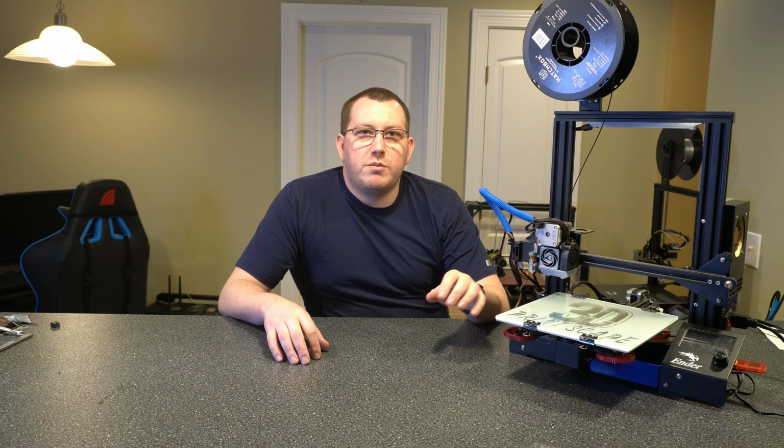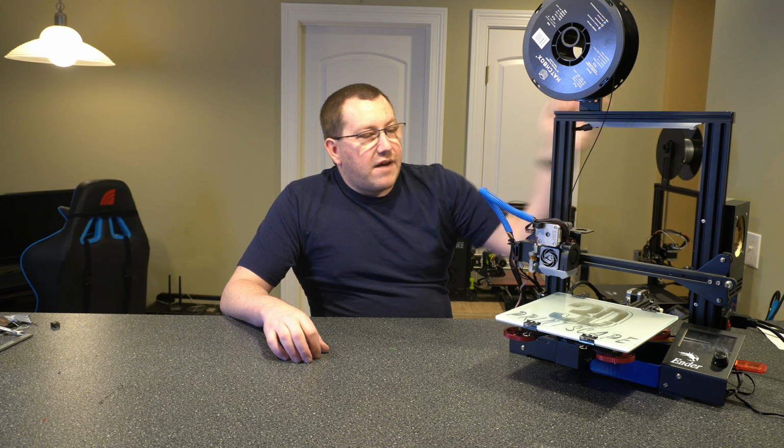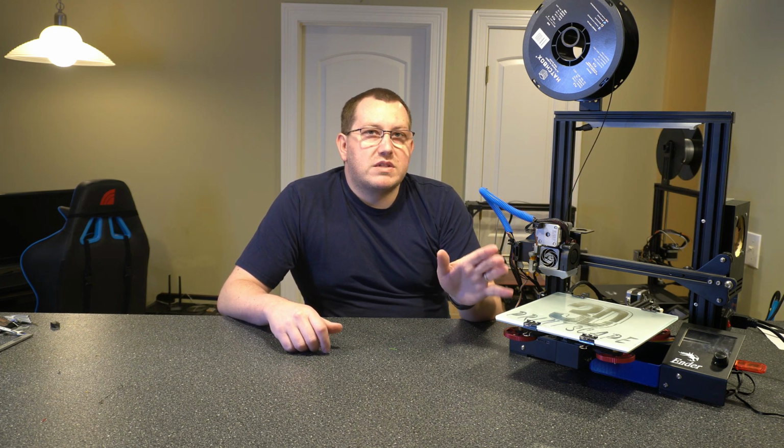And for those of you looking to reduce the overall noise output from your printer, like I said in the video, upgrade to a silent board if your printer didn't already come with one. Some of them do have them, like the Ender 3 V2 and some of the other ones. And then replace the fan on your power supply like this guy. Because after I switched to a silent board, the next loudest thing by far was the fan on that power supply.